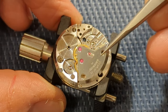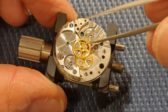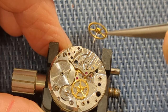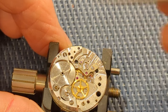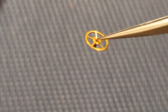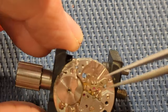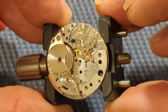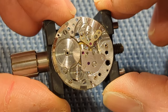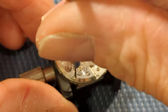I'm just fiddling around with the screwdriver — where's that notch? Not there, not there. Finally I give up and just go to the edge to pop it off that way. I am worried about the pivots though — this is not the proper way to do this because you can quite easily snap a pivot off one of the wheels. But that didn't happen thankfully. This is a really interesting design for this movement: instead of the bridge holding all the train wheels in place, there are a few internal bridges, which I find extremely fascinating. It really is a well-designed and very ruggedly built movement.